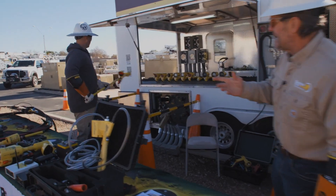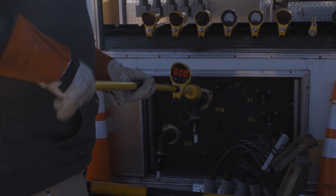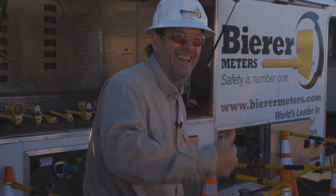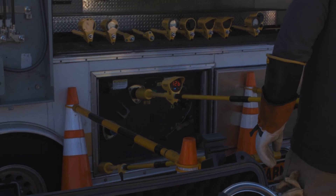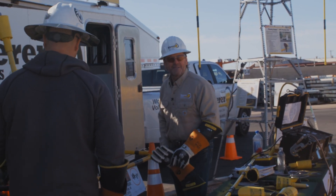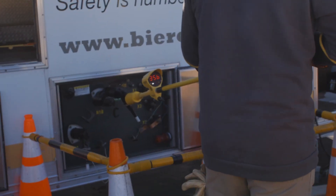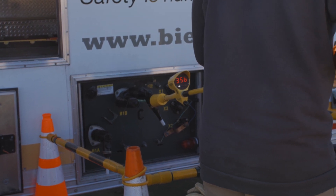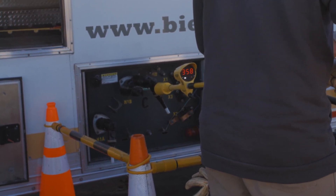The wiring in this trailer is really bad and gets a little confused, so let's see if it works. We're getting zeros and a white light — what phase is that? A phase. Now go to that hot bushing — 20,000 volts, 200 volts, doesn't matter about potential. We get a blue light — so that's B phase. Now going to that capacitive test point, it's starting to flicker. This is where we were having trouble yesterday — it's getting confused. We know that's A phase over there, and this is B phase — we need a zero-ohm extension because it's too close to something.